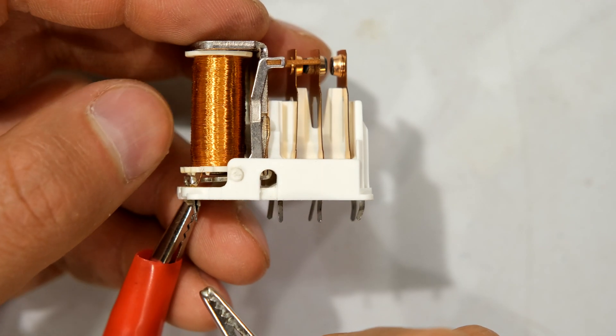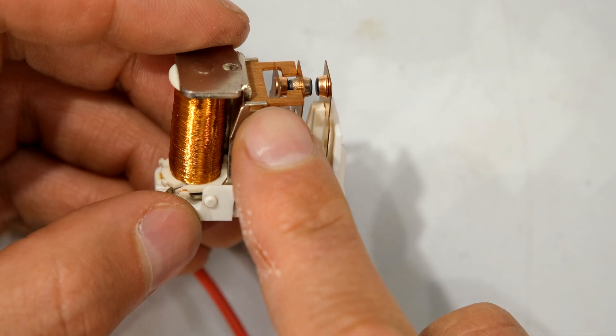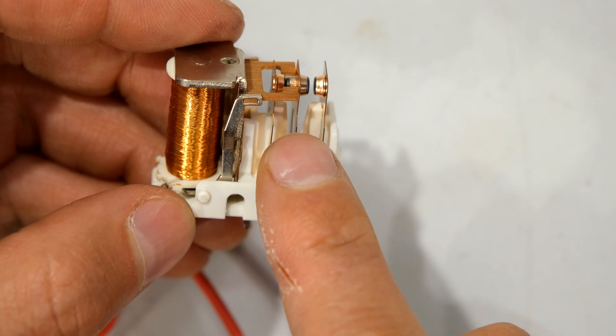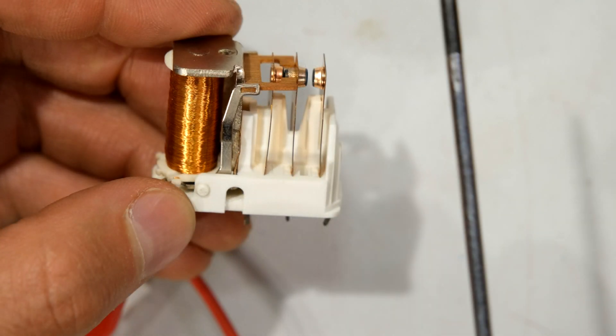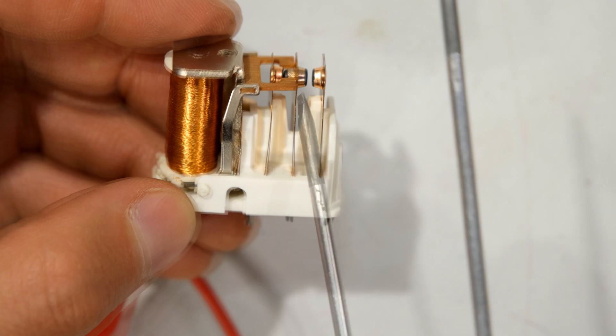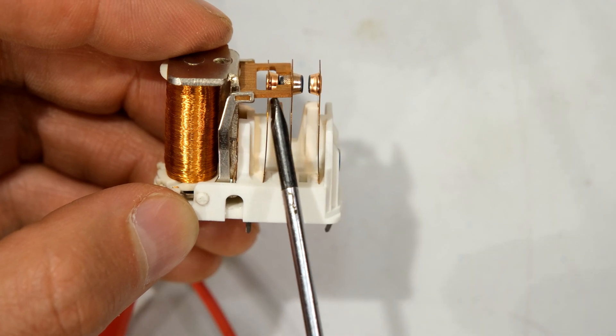In terms of the relay, the coil attracts a platform, but that platform is galvanically isolated yet linked to this conductor which moves — it's like a leaf spring. To maintain the galvanic isolation you can see they've used a piece of wood between the contact and the coil side, and that's what maintains galvanic isolation. On other relays they use plastic pieces — anything that does not conduct electricity. So that piece of wood transfers the magnetic force onto the contact, allowing it to short out terminals or open a circuit.